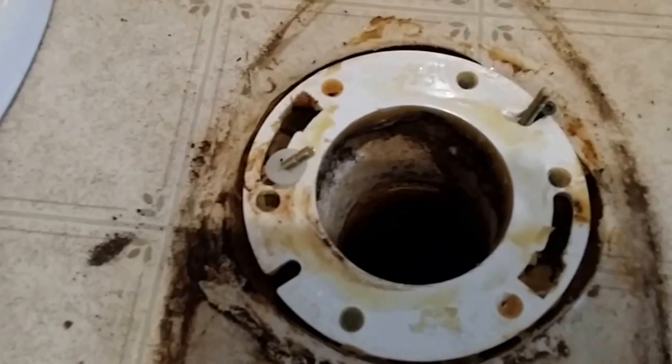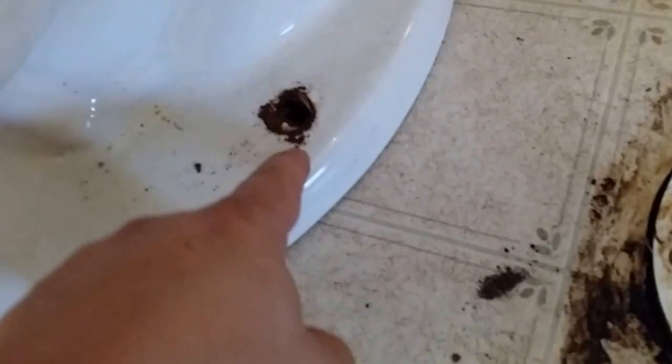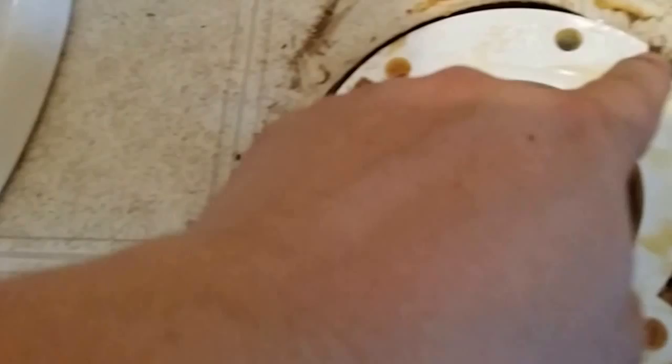Something else to keep in mind - and this is what I had to do upstairs, though I didn't get this figured out until afterward - here's the toilet. I was actually able to put my deck screw right here, right down the hole, right beside my bolt, stabilizing my bolt up here. And I was able to put the nut on and finish the job. So a 3-inch screw on each side can do wonders, especially if you already have the toilet placed and you find out your bolts won't hold, like happened to me. Thanks for watching.